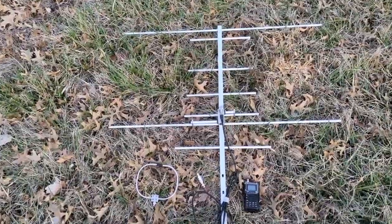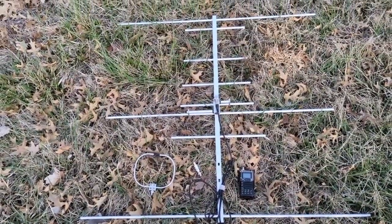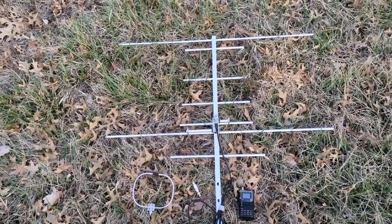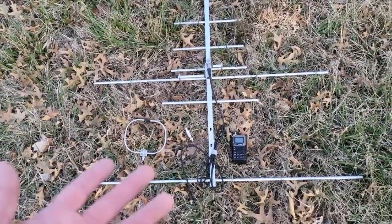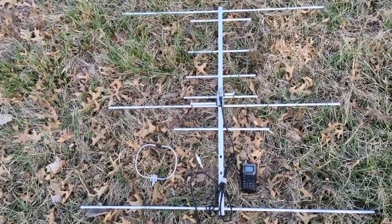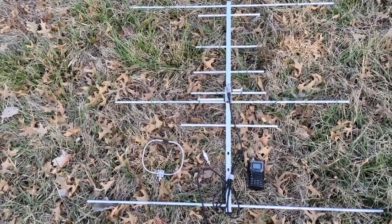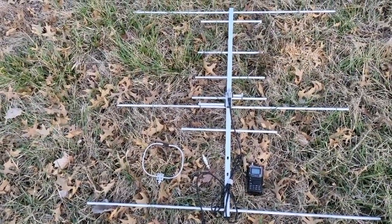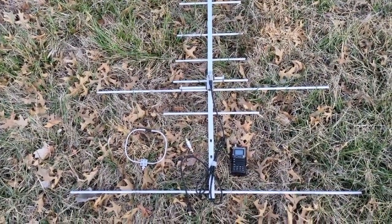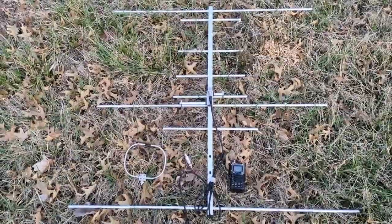If you're trying to take a bearing, make sure you turn all the way around in a complete circle at least once. You'll notice peaks and valleys as you rotate — the highest or the lowest point is where you take your bearing from depending on antenna type. On a Yagi, the highest peak is your bearing; on a loop, the lowest null is the bearing. If you can't get a good bearing — especially with loop antennas, if you don't get a null on each side — it might be because you're getting signals bounced off buildings or landscapes. If you can't get a clear null or clear peak, try a different location.